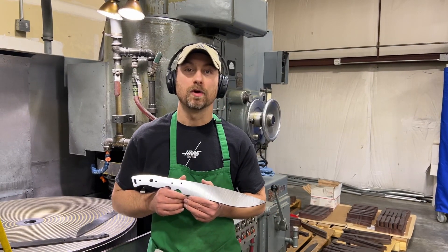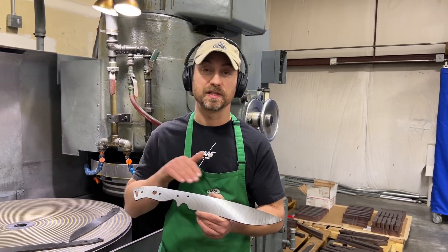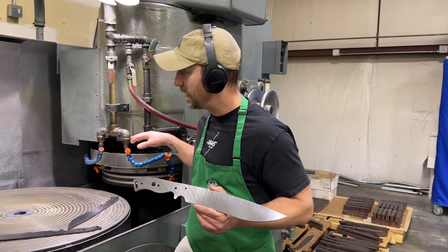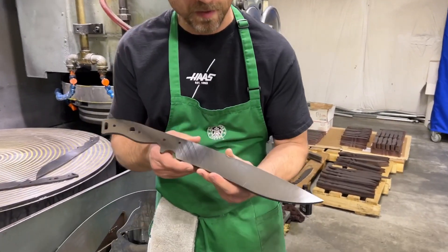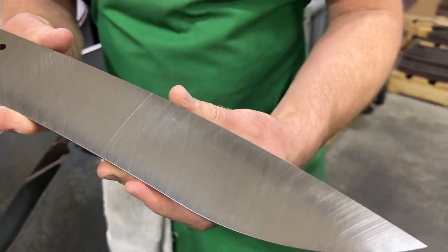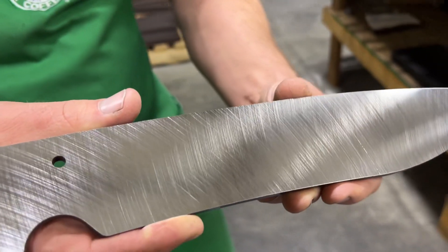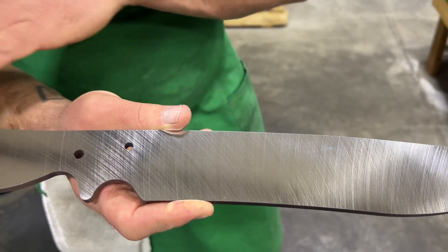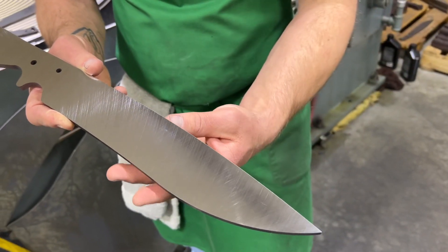I just really quickly wanted to show you guys the finish on this blade. This is exactly what you guys with these big GSO 12s, 10s, and 8s — this is what we've been working toward and we're finally there in our development. I just want to come in here really close and show you — that is a gorgeous Blanchard finish. After we dust this off about five tenths on each side, we'll get that grain pattern much much smaller, so all that will erase in surface grinding.